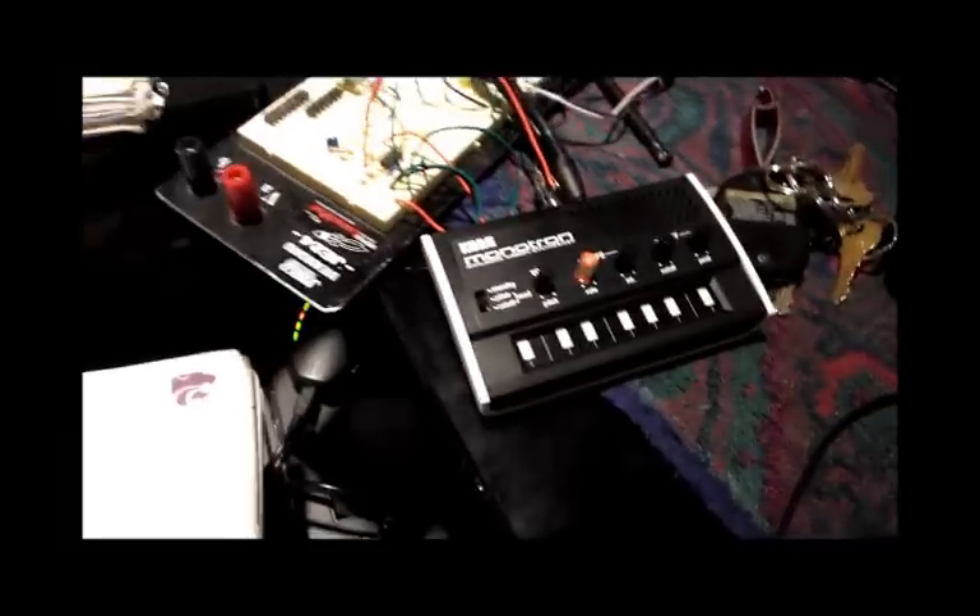It works. The circuit board kind of looks like a mess because I had to tweak the resistor dividers to get the square wave and sawtooth to have approximately the same volume, and I only had 10K and 1K resistors lying around, so I did a lot of series and parallel combinations to get them to the right volumes — but it's pretty trivial. Here is a demo of how it sounds, recorded in Ableton so it'll be higher quality.